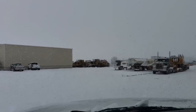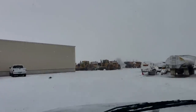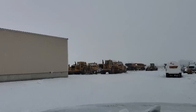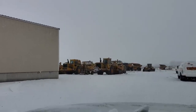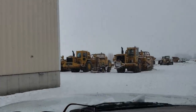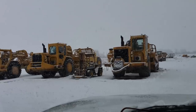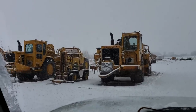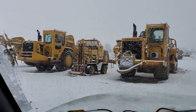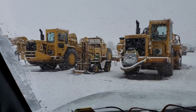We still got the service truck in the shop. We're waiting on parts. Matt took the forklift and got one of the steering cylinders off number two there. For some reason, she has an old-timey steering cylinder on it with the old-timey packing type seal on the head. And so we got to find a new head to put the newer style seals in.